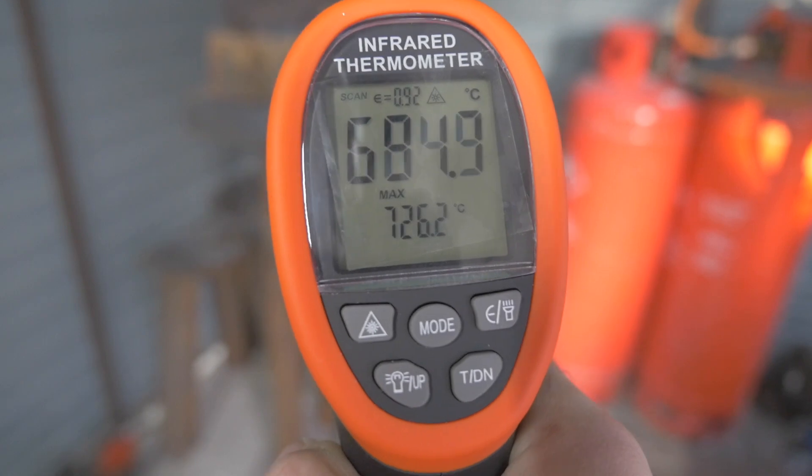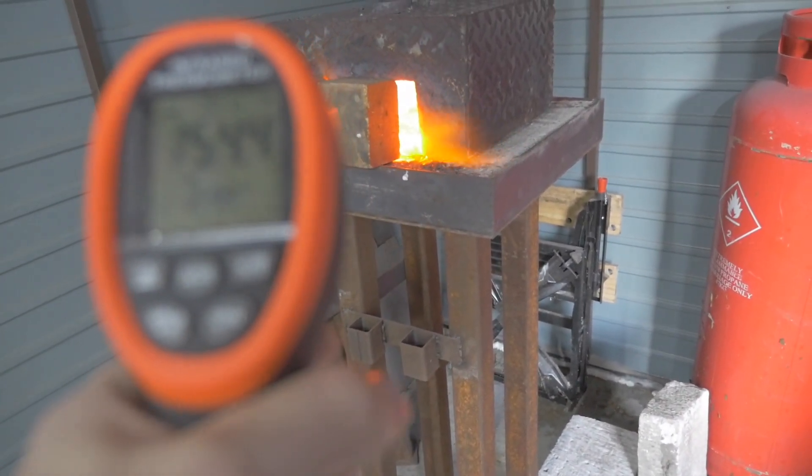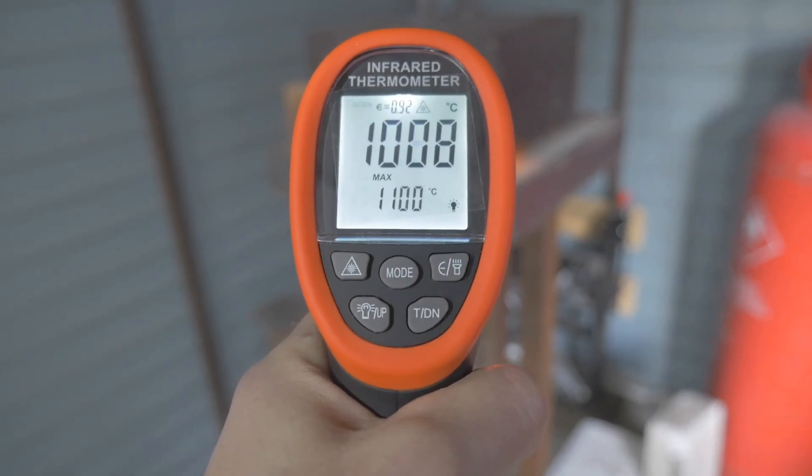700. Wowzers. So the forge got up to about 1,200 degrees C. I might put it on again in a bit and just leave it running for about half an hour to see what final temperature it gets to. And that's not with it fully open. But you can see the thermometer works really, really well. It's going to be perfect for me to control that temperature on that forge. So when we do a Mokume Gane later, we now know we need to get it to about 700-800 degrees, depending on what metals we're using.